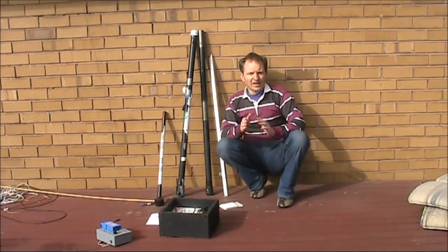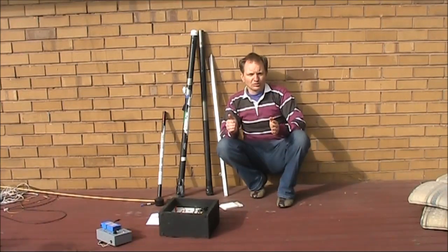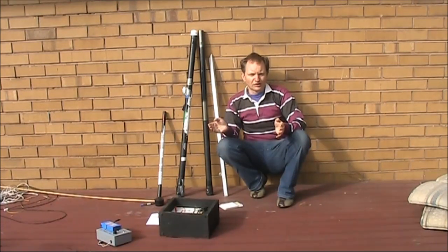How do you know which is which? Here's what I suggest you should do. Get a free-running RF oscillator with a large open coil. Put the material that you want to test near that coil and monitor its output frequency. If the frequency varies, then it means that what you're putting near it has some effect on RF. If the frequency stays the same, then you're safe and can use that material.